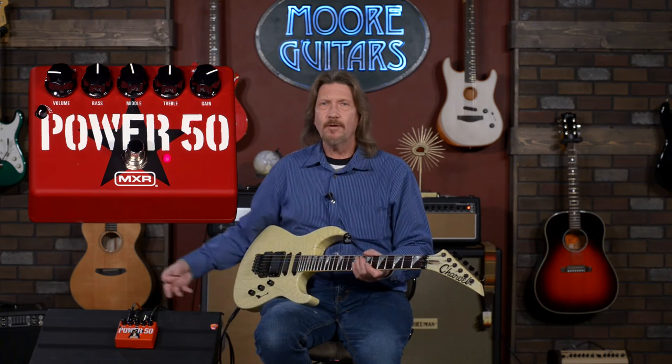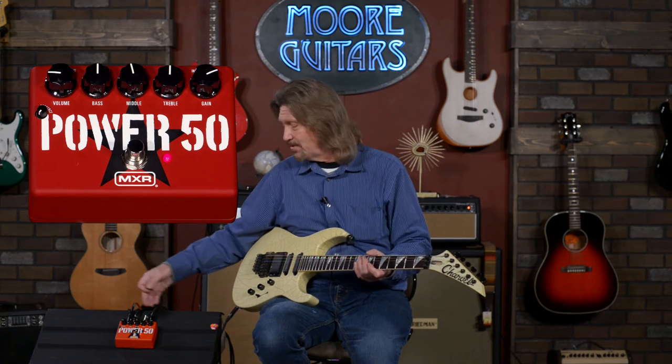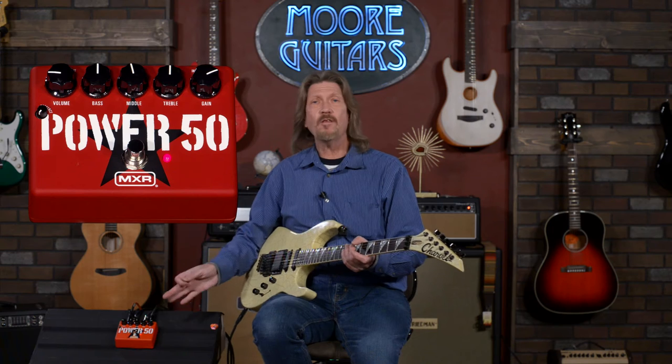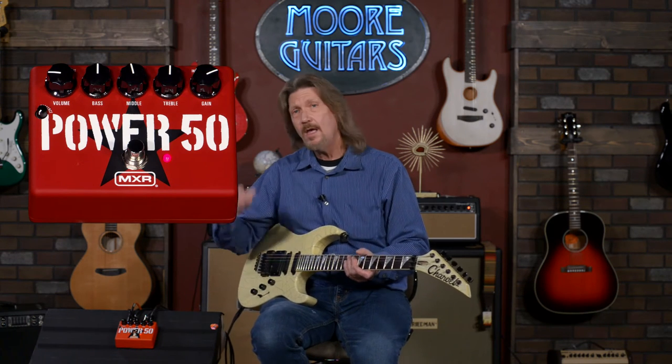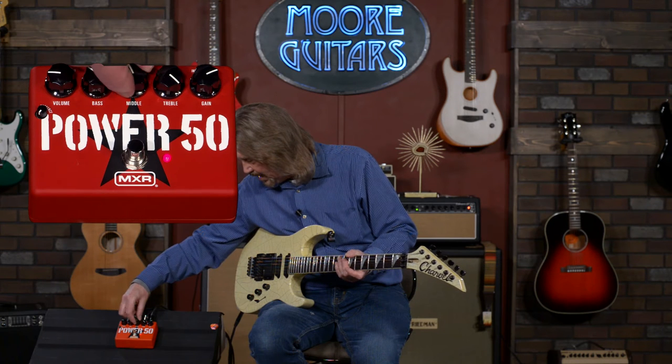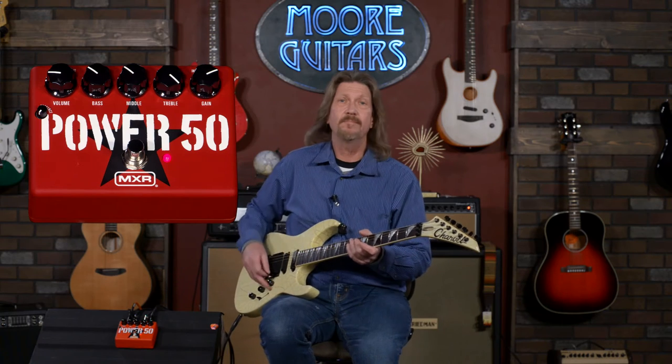You can still hear that good low-end thump, but because of the changes between the 2204 series and the 2205 and 2210, we now have a diode clipping circuit. I really didn't like it in the early Marshalls when they first introduced it — it adds a very harsh raspiness, a not-pleasing type of distortion, very aggressive. That may be something Tom appreciates, because on his amp the treble is almost dimed with bass and mids down just a little bit.